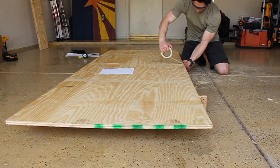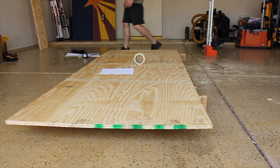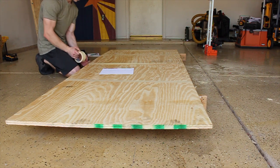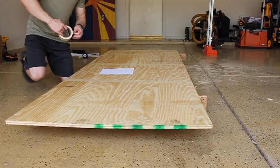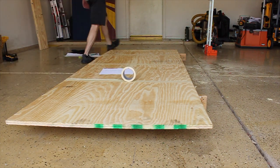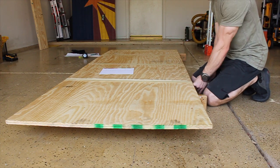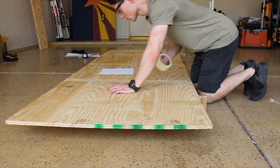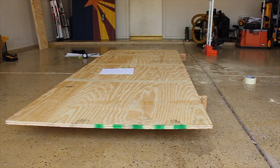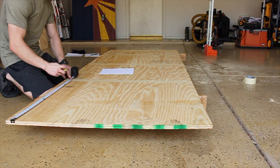I bought 2 sheets of 3/4 inch plywood for the carcass portion. I had the big box store rip it down to 37 inches wide, which was slightly larger than my infeed and outfeed tables in their working positions. I really wish I spent the extra money to buy Baltic birch plywood instead, but I figured I'd save a couple bucks and build it out of the less expensive stuff. I'm sure there will be a second series in the future where I revisit this build and hopefully remake it out of some nicer materials.